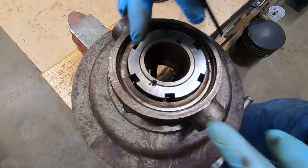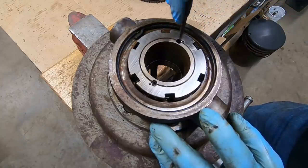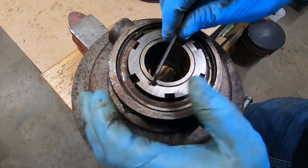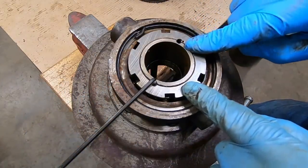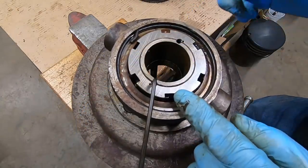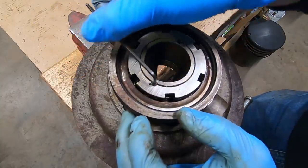The way they do that: once the nut was installed, they drill a hole that's basically half in the hub and half in the nut, thread it, and put the set screw in. So you do not want to mix up the nut and the hub — keep them as a matched set. If you swap nuts around, these threads will never line up again. Work through that staking mark.